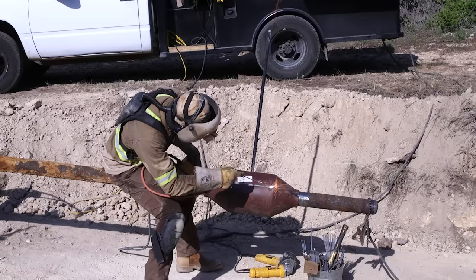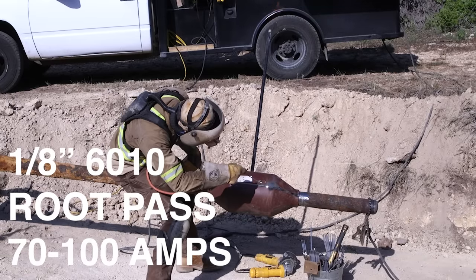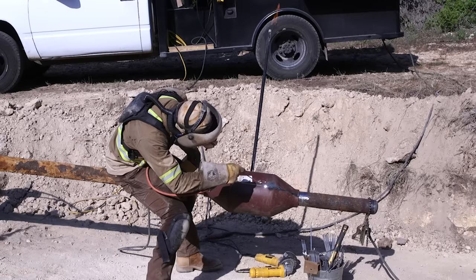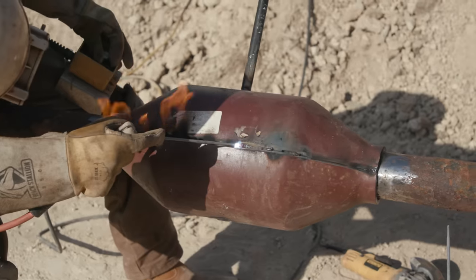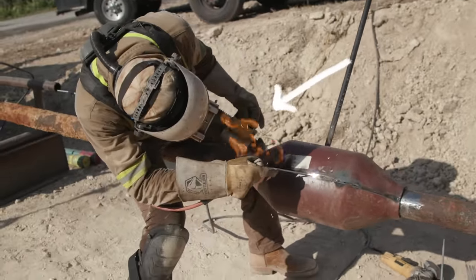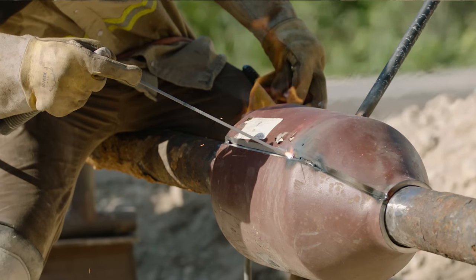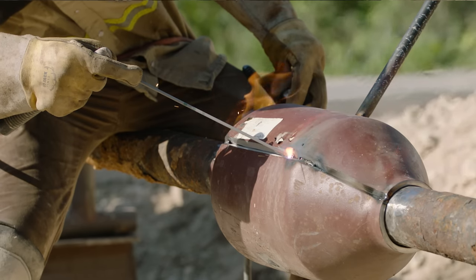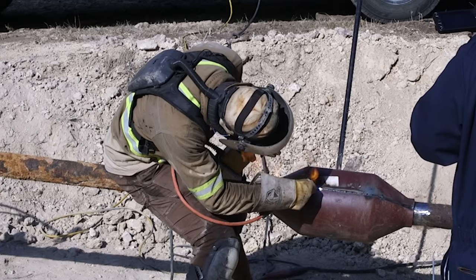That's on. All right, first strike up, trying to get an idea of where my heat needs to be, trying to get an idea of where the flare is at. Obviously, it's right under my nose. You can see on my left knee, I've got my wired remote working that heat. On a lot of these split sleeves, you'll go from gap to tight, gap to tight. The bevels are just always cattywampus all over the place. That section is actually pretty good.